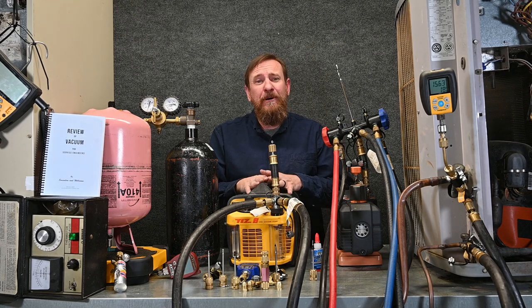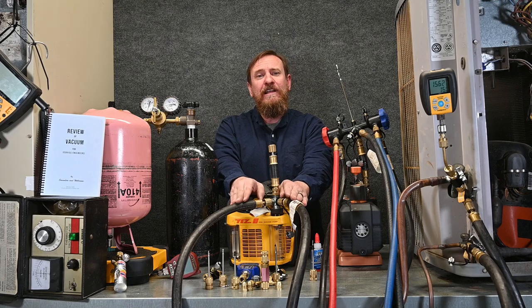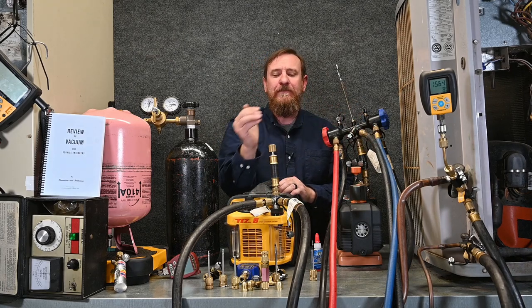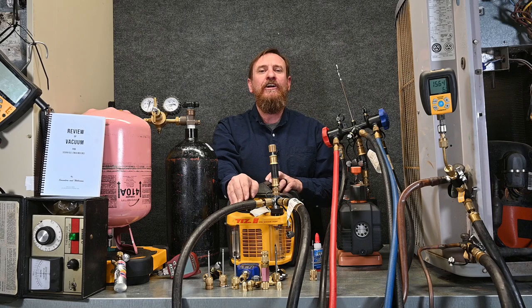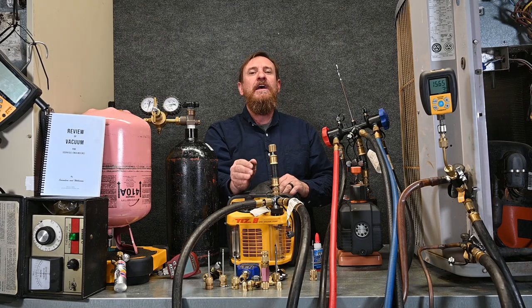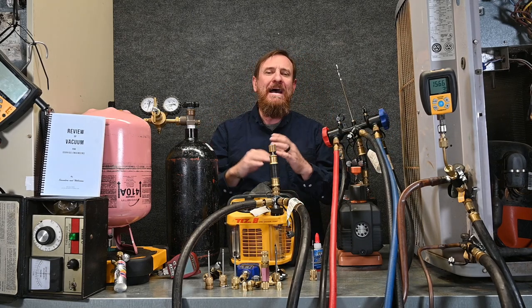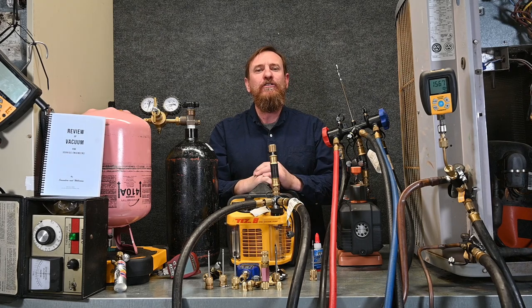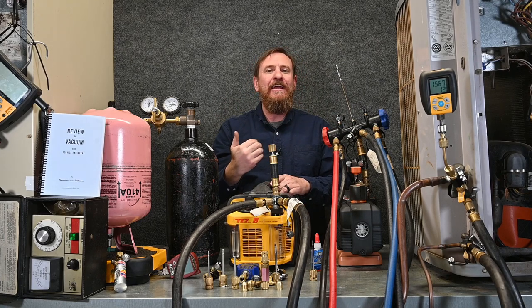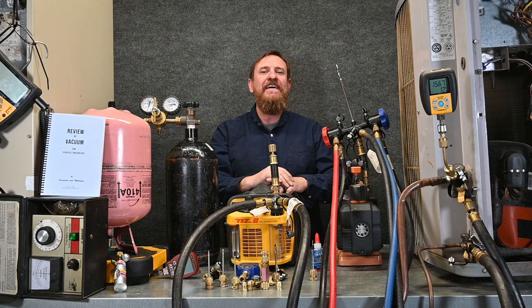What's more important than the pump itself is going to be the hoses. Making sure we have good, thick, quality vacuum-rated hoses with no oils — we're not using them for anything else, only vacuum. These vacuum-rated hoses aren't going to permeate like your other hoses will; they don't have oil in them like your other hoses will. They're made for vacuum and they're large, thick, and as short as possible. On top of that, we want to make sure we remove those valve cores. The valve cores inside the system are a massive, massive restriction — they slow the flow down so incredibly much. We use valve core removal tools to get that valve core out of the way so we can really flow all of that air and moisture out of that system as fast as possible.